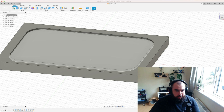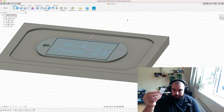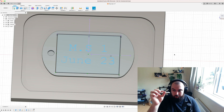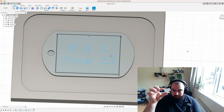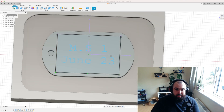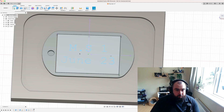That'll be one toolpath. The next thing I have is the actual dog tag modeled in Fusion 360. The model isn't exactly right, but it doesn't have to be — what matters is the thickness is correct at about one millimeter. I have a bounding box for the text that should fit inside the center of the tag. I just need to roughly find the center when setting up the machine, and the engraving tool will be able to navigate correctly.